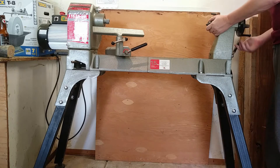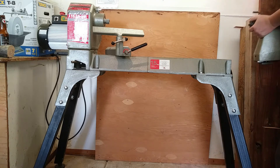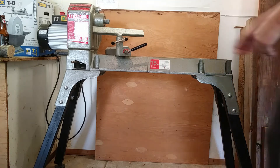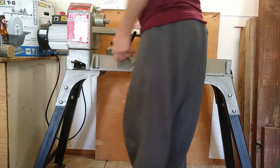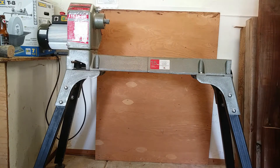On that note, I recommend that after reading the instructions, the next thing a person should do is completely take apart and put back together their lathe. It builds confidence and understanding of the machine, and it can reveal things about the lathe the owner didn't realize it could do. It's also a great chance to check for rust, loose parts, and to grease it all up and give it a solid coat of paste wax to get started right. Once I had done this, I could break the lathe down so that its heaviest part is around 30 pounds, and I'm confident I could put it back together correctly with just a few simple tools. Still, I'm glad I did take it all apart, and that's how I'll do it with my next lathe too, because I definitely understand this machine much better after having done so.